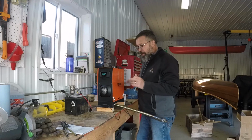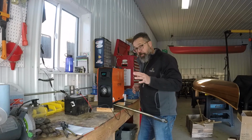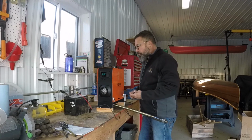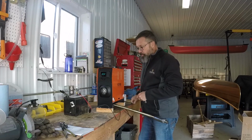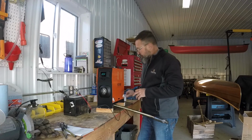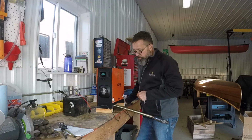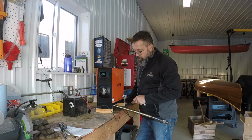I had a little hiccup because I don't have a proper 15 amp supply. So that's something that maybe the website should be more specific about, the power supply. I should have known. It's a big thing. It's got a motor, so 15 amp is reasonable. The little adapter of 5 amps wasn't enough, so you need a 15 amp converter. But plugged into a battery directly works like a charm.